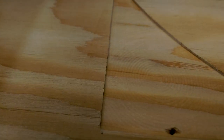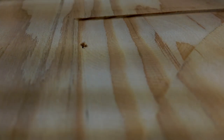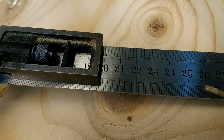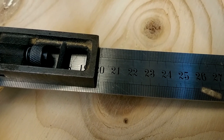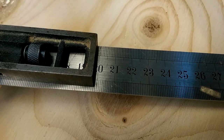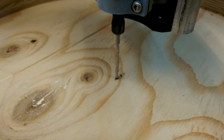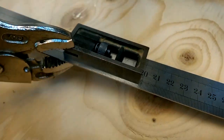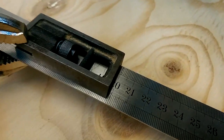Let's go. I think that's some reasonable fidelity on the edges, doesn't seem to be overloading the tool, not damaging the wood with any tear-out too badly. I'm going to get this reoriented and centered and then let it run. I've cobbled together a little story stick - the inside diameter of those rings is supposed to be 400 millimeters, so I've got 199 millimeters and then a stop block, and I'm going to run that up against the bit. If I can get it centered so that this spins freely around the outside, I will have it centered because I'll have an equal radius in all directions.